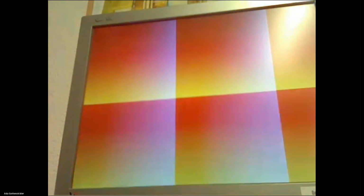If I wanted to make this a bitmap display, can I fit the bitmap in? Probably yes. I have to calculate if we actually have enough memory for a simple bitmap, 640 by 480. Actually, we may not have; doing a 16-bit bitmap is a bit too much.